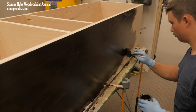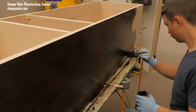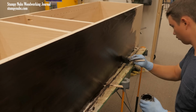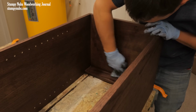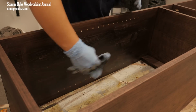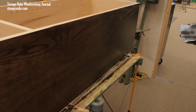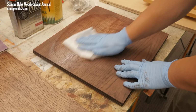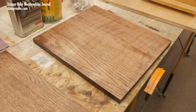He was applying stain to an oak cabinet. I don't like to use a lot of stains, but I think this dark brown gives the cabinet the contemporary look that I wanted. Anyway, he took care to fully wipe off the excess stain as he applied it. And it sat on the wood for well over a week, so we know it was fully dry. But when he tried to apply a wipe-on poly top coat, the stain started coming off. It was a mess. In the end, the panel was significantly lighter and blotchy, and it just looked terrible.